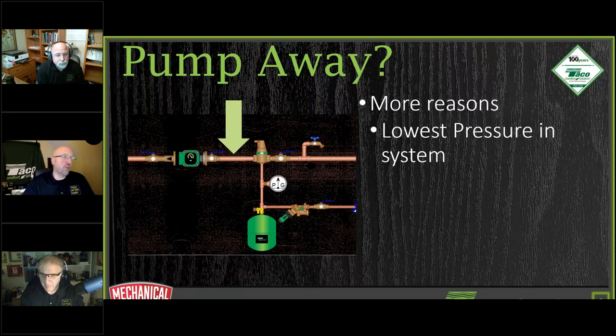Yep. So yeah, I was going through the instructions that come with the circulator. So actually, if you were to take that drain valve that we showed you before and use this one instead, now you've got every bit of pipe. The only thing that's going to have any air in it is going to be really right here. You're going to pull the water in, and the water's coming in, going out that way, going throughout the system and coming back over here. So you just have this little bit that's going to flood out. You've already gone through the boiler itself.